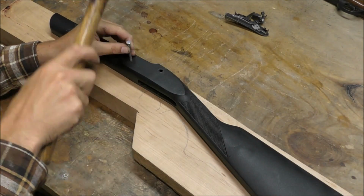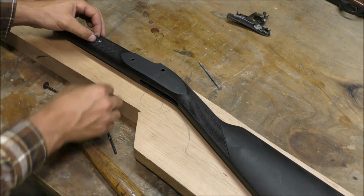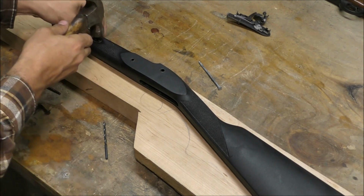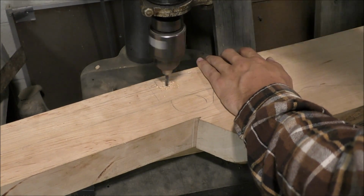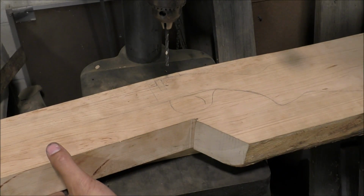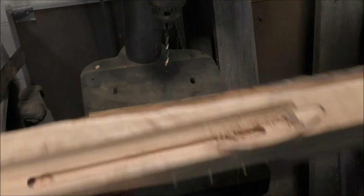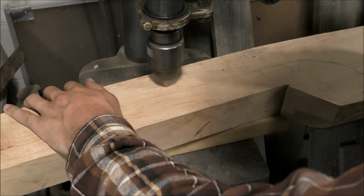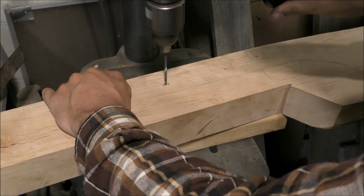While everything was still flat, I decided to drill out some of the holes that go through the side of the stock, and these first 2 that I tap in were actually a mistake. I shouldn't have drilled those yet. Those holes are for the screws that screw into the flintlock plate, and I should have waited till the flintlock plate was inlaid into the wood itself before I drilled those holes, and I'll show you later on in the next video how it created some misalignments that I didn't really foresee coming.